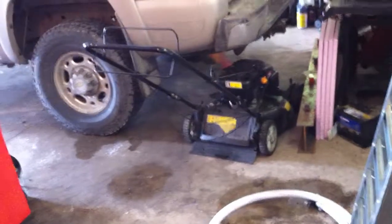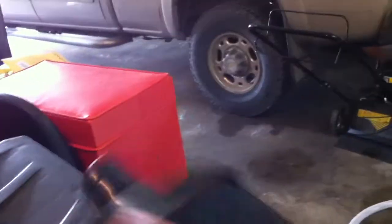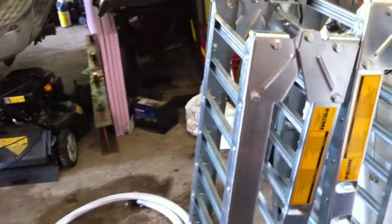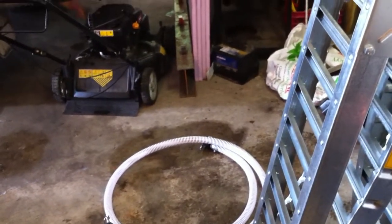Basically what we would do is with our suction hoses, we always had the strainer and the check valve pre-fitted, and you put that on the pump and you would shake it back and forth, and that would eventually fill the line.